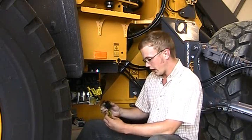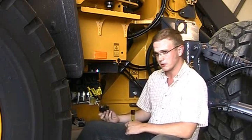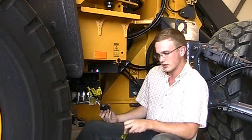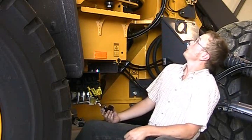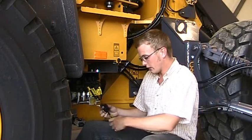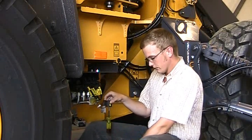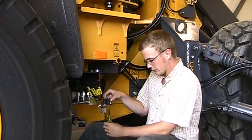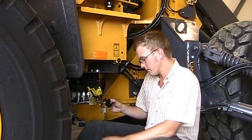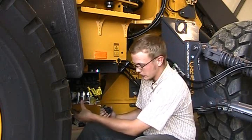The screwdriver has no attraction to the float coil whatsoever. I've got somebody up in the cab who's going to press the float button, and we're going to test to see if this thing is indeed getting magnetism or not. So we can press the button. Now I'm feeling magnetism on this screwdriver — it's got enough to hold the weight of the screwdriver. That's proving that we're able to shift this spool inside and open up our float circuit.